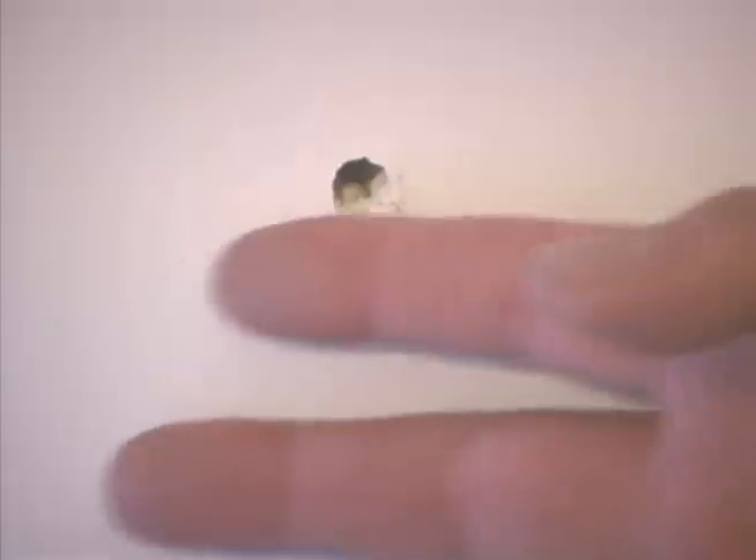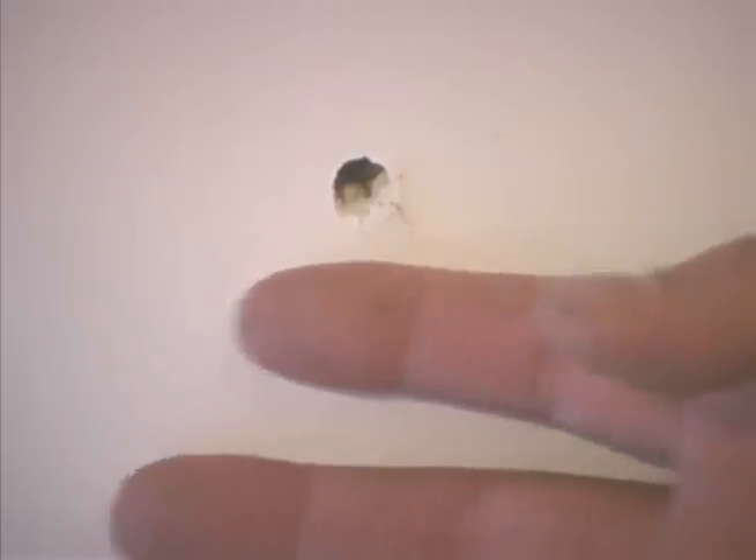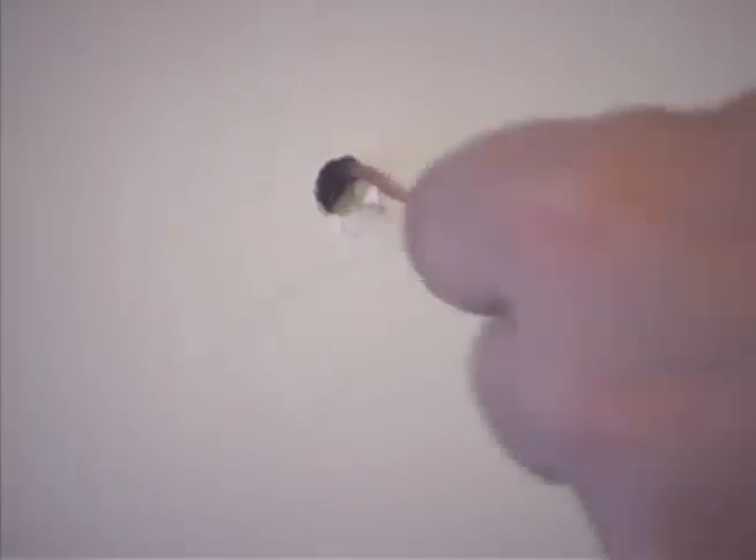If you do not have baseboard, go about an inch from the floor. Imagine a piece of baseboard right here — what we have done is dropped our string down behind the wall. I took a small piece of wire and bent a little hook in the end of it. Now we are going to take that wire with the hook and put it in the wall.